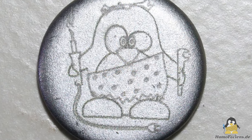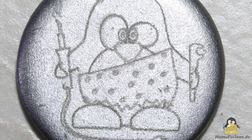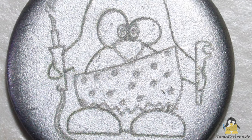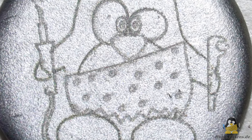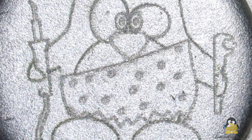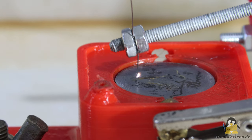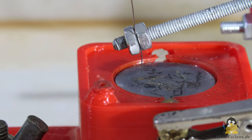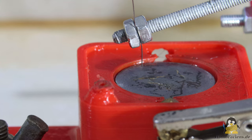The engraving is not too deep, but clearly visible and the lines have been transferred to the metal disc without interruptions. Short horizontal lines can be seen at the small circles. By attaching the electrode to a rotating lever, it inevitably moves in a horizontal direction along the surface whenever it is raised or lowered.